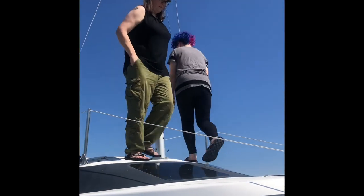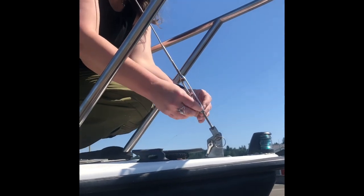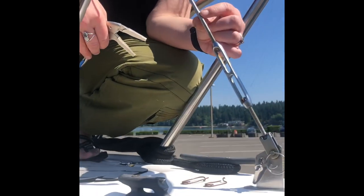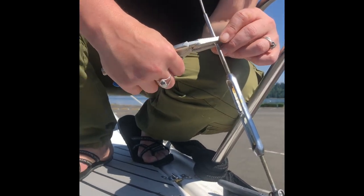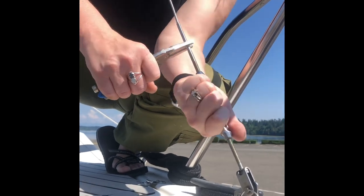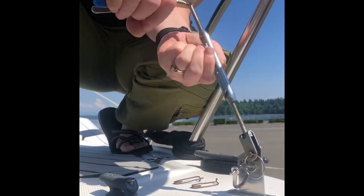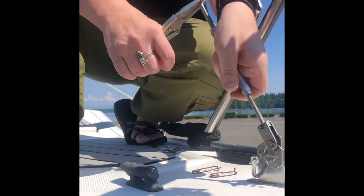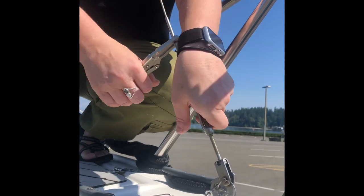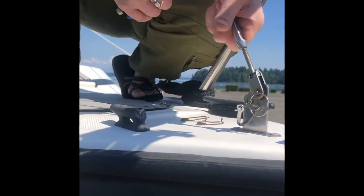Now we're going to tighten the forestay. I like to use these vice grips. We have cotter pins on these — these ones are really rusty, they probably need to be replaced. There is a flat part right here on the forestay itself that helps keep it flat, because you don't want to twist one of these without twisting the other one. This keeps the cable straight when you twist this to make it tight. It goes left to go tighter — I'm doing it counterclockwise. You're twisting this thing counterclockwise to tighten it, and you can see it's becoming more tight because these are becoming longer.